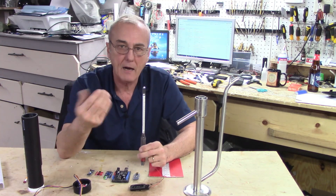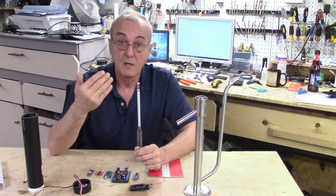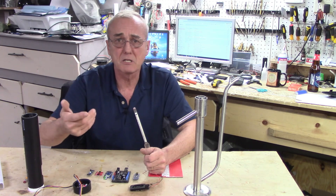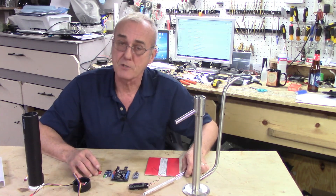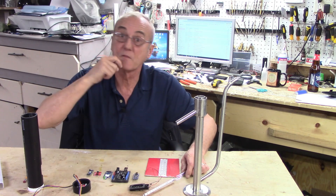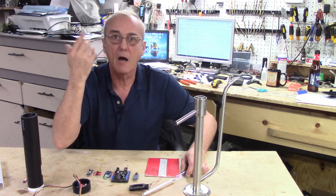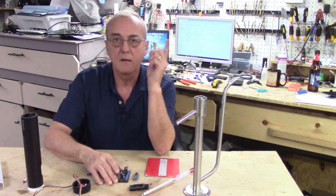We needed to figure out how to track the up-and-down movement, and we thought about just about everything — from RFID tagging to magnetic resonance — a multitude of ideas. Just like Edison, we found a thousand ways that didn't work. One that worked extremely well was a time-of-flight sensor, which is a laser that's shot out. Using the speed of light and the reflection of that light, there's a simple formula to figure out how far away an object is. So we use a time-of-flight sensor with an Arduino.